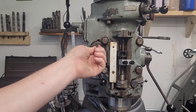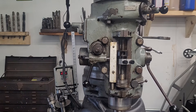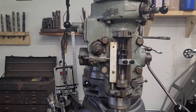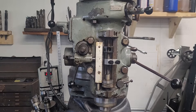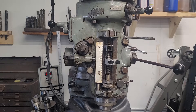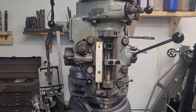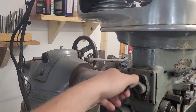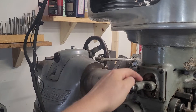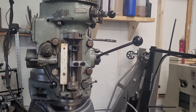You can run the power downfeed down, or you can run it up. We're going to engage it in reverse so we can back-bore parts. There are a lot of functions on these heads that aren't always immediately apparent — I think we have about 15 or 20 controls on the whole machine. I'm running this in six thou per rev. With the machine running, you can select different boring speeds: one and a half thou, three thou, and six thou per rev. We're running much slower now.